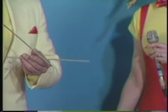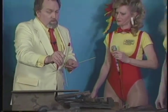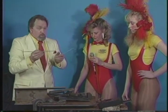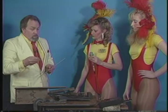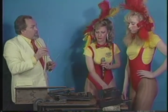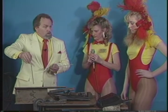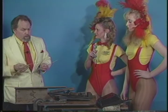That means that as you're welding along, you scratch that arc in order to establish it. You scratch the material, and then you hold it perhaps 1/8 of an inch away. As you're welding along, you have to continually keep bringing the electrode down because you're consuming it. This is called a consumable electrode. You are actually using it up as filler metal going into the material. So that adds to the degree of difficulty of the welding technique. It's not just like you had a continuous length piece of material and you just held it at that length and went along. You have to keep coming down as you're using it up. Is that clear? Yes. Okay.